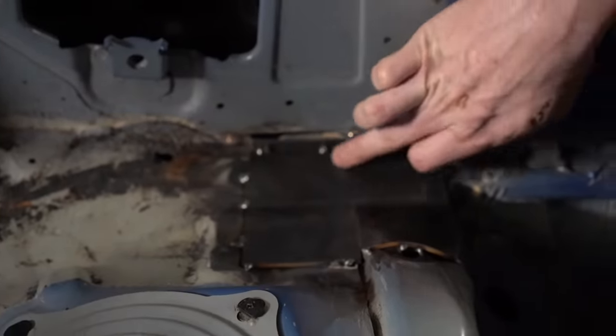This measurement here, when you're measuring it on the chassis, the bend needs to start slightly after the body starts to bend. So if my body windowsill starts to taper in towards the roof at around 19 inches, I may want to start my bend around 21 inches. It varies between chassis, but that is typically what I've found when designing the main hoop.